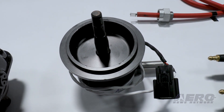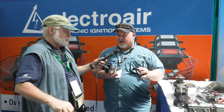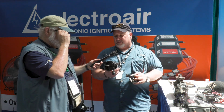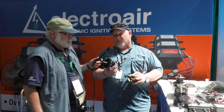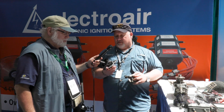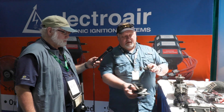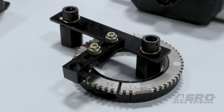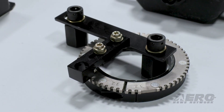For the four cylinder, the requirement is that you end up with two ignition systems with two trigger points, so both ignitions are now completely separate — not tied to each other in any way, shape, or form. We use what we call a mag timing housing, which drops in place of the four cylinder magneto.